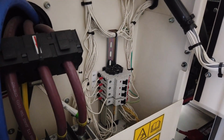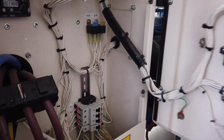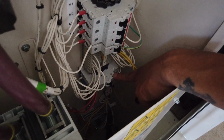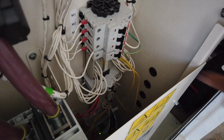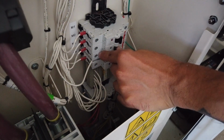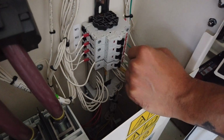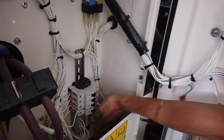When you turn that off, your controller will shut down. So it should always be on. Even this one, the last one, this is for your 220 volts from Ormeco, the supply for the charger. So all of those should be on, sir. Make sure that all of that is on. Because for example, if this one is turned off and you run the genset, it will malfunction, it will shut down. Maybe it will trigger under voltage. So make sure that all of that is on.